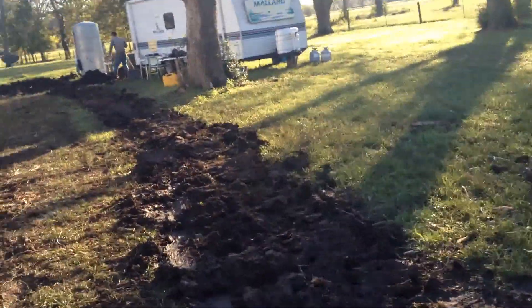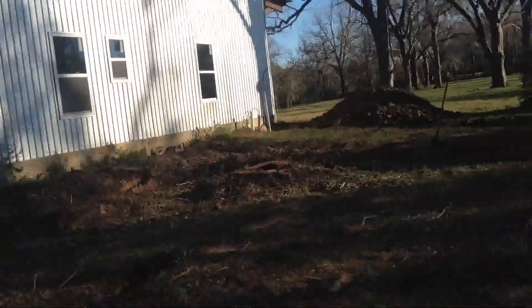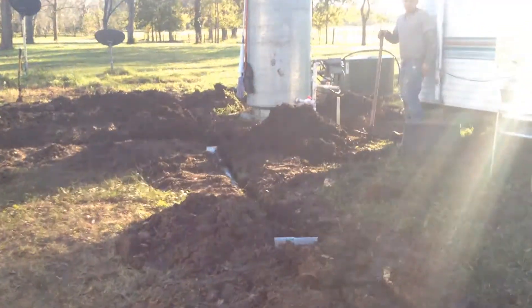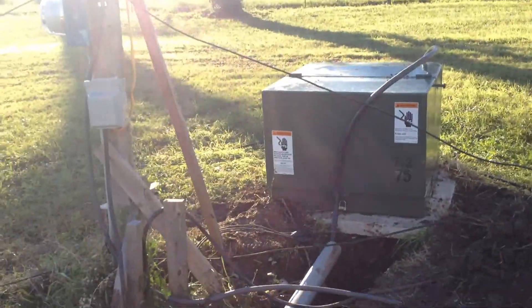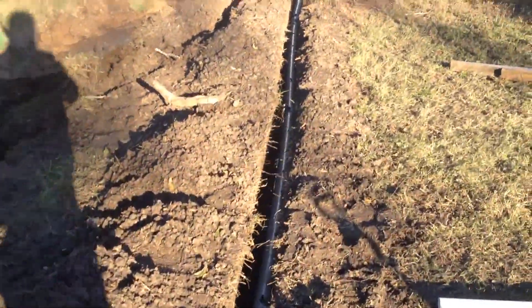The ground is still wet. I have to go over it a few times. But that big tree that was here before is gone, and I have ordered three loads of select fill. I wanted to show before we covered it all up — that is one of the drains, the gray water. So this is where our line is. This is my main water line, and here is my line for my barn. Here is the actual main trunk. That transformer. Here is my line for the well. So that is ready to go. Here is the main, waiting. I am going to put a little 22-degree angle there, make it look nice. So here is what we are going to do — I am going to cover this up now.